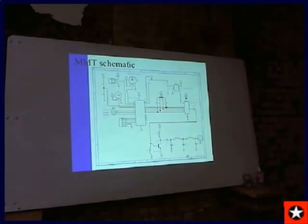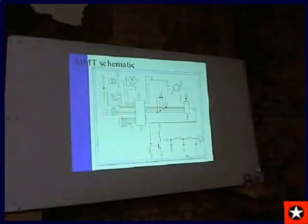I've had reception at 400 miles with 25 milliwatts. My record for reception from a balloon is 508 miles. And I did that with this transmitter flying over Missouri, which is 508 miles away, running 25 milliwatts on 2 meter FM. Now, I will preface that with one thing. I live on a 500-foot mountain, and I have antennas only 8 feet up, so it's as if I have a 508-foot tall antenna. And as we all know, antenna height is everything, particularly when you're at 100,000 feet.